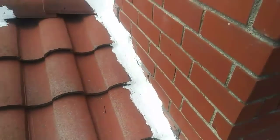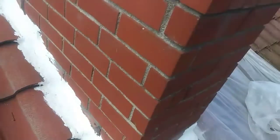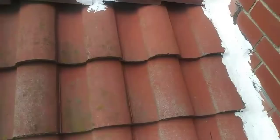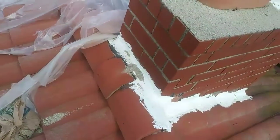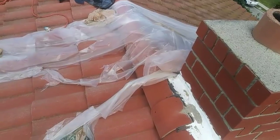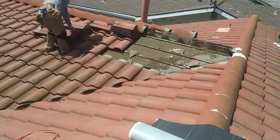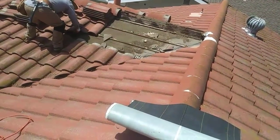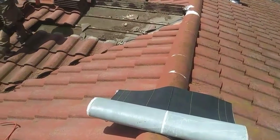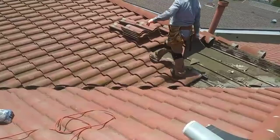I'm going to send a video on YouTube so I am going to teach you how to do it the proper way. First you are going to have to get rid of this mess they made, then move the tiles around and start from scratch. Fix the valleys — please do not leave the battens close to the valley, because then you create a lot of problems for the next roofer. They have water leaks on that side, they have water leaks on the other valley. In this video I am going to show you how to do the valleys. I am done with the fireplace and I am installing the flashing.